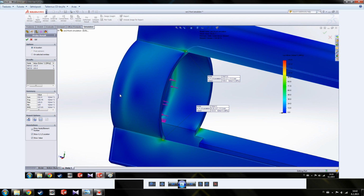Alright, I just did some simulations regarding the radiusing of the cylinder window corners on a version 2 gearbox, and here are the results. So this is the stock gearbox. I put a 600 Newton force applied on the front of the gearbox, which is quite a lot, but the point of this is just to show how the load distributes around the front part of the gearbox.